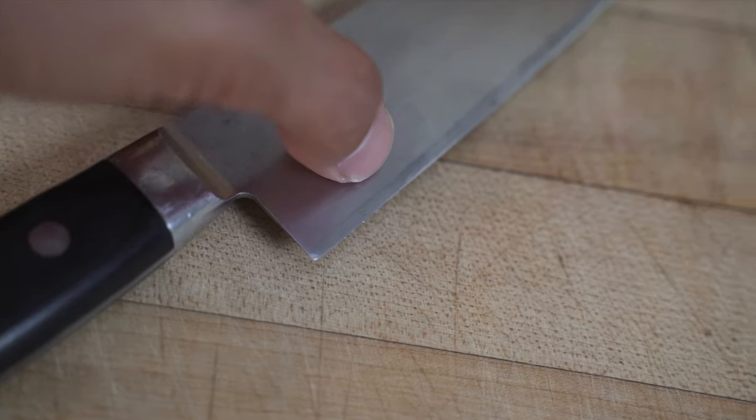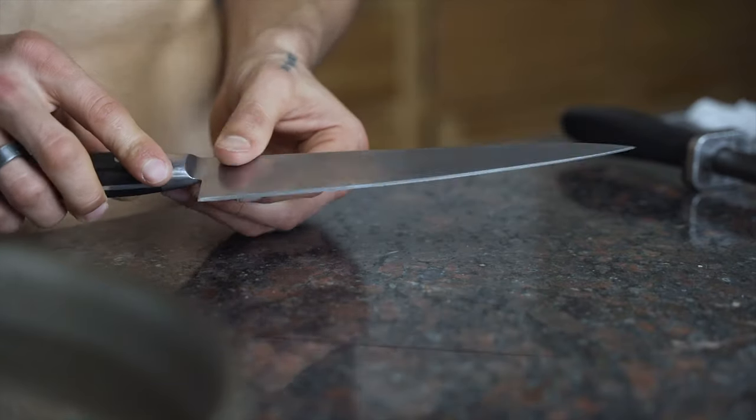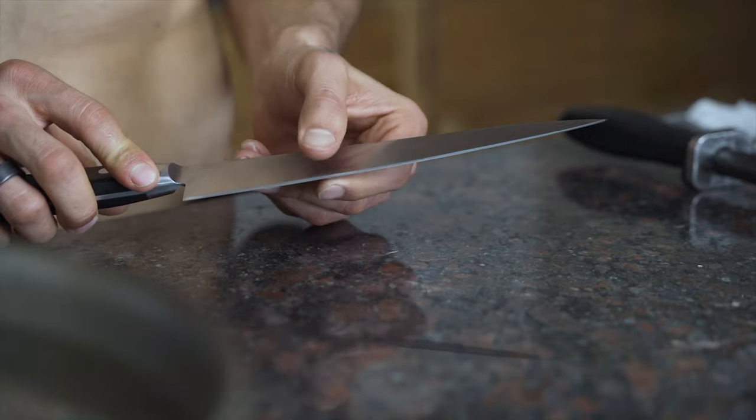You're looking for the knife's bevel. This video is gonna be a little bit longer, and I don't want it to get too long-winded, so I'm not gonna explain all the different parts of the knife, but in reference to how I'm gonna actually sharpen this knife, I need to explain a little bit about the shinogi line, which is where the blade starts to taper down. Then the whole strip here, that's actually nice and shiny because this is super sharp, that's called the blade road. And then the very bottom, just where it comes to the tip, that's the bevel. And that's what you're trying to find.